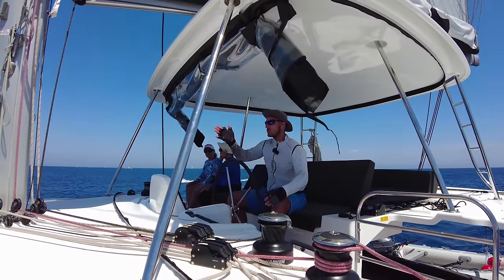Now there's a catch. The main, you always put up and down heading upwind. Now for the jib, you wanna have it on an angle, at least 40 degrees apparent wind angle, or even more. The best is to go 90 or even a little bit downwind. Why? Because if you open now, the sail is just gonna flap, flap, flap, because you're straight upwind and you're causing wear and tear. Now, just by going a little bit off, the sail will catch the wind immediately and there's gonna be no wear and tear.